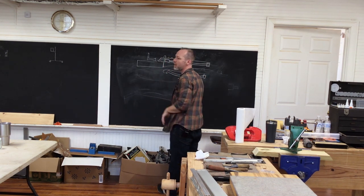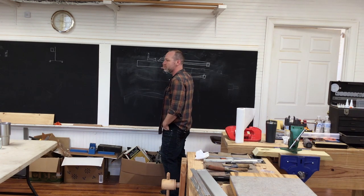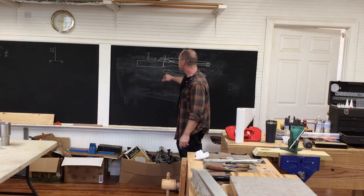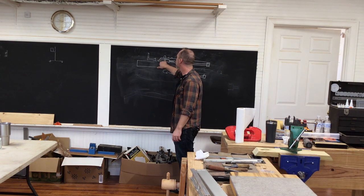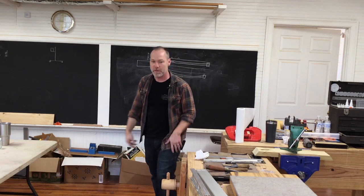And then once you get it out, now you can use a screw extractor. I've gone through so many of them where I'll take a screw extractor and try to get it down in there. Sometimes I'll enlarge this hole since I know I'm gonna be scrapping the plug. Put my screw extractor in there and then be able to turn it and get it out.